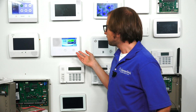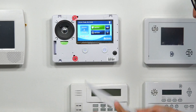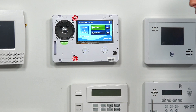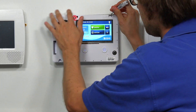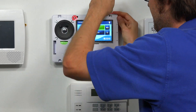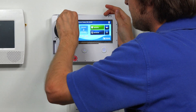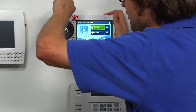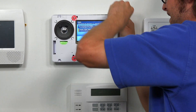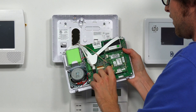The process for installing the communicator is pretty simple. You have to open the panel, which I'm going to demonstrate now. You just take this front plate off — kind of get your fingernail under there and pull it off, it pops off. Then the tricky part is taking this off. You see 'unlock before opening' — if yours is locked, you can release it there. You just stick your flathead screwdriver in there to where it comes out. Got it open. Here's the inside of the 2GIG GC2E.